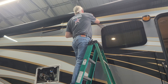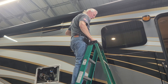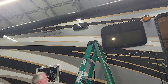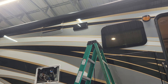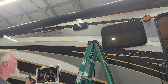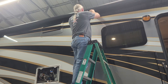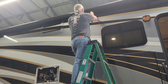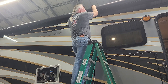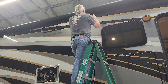I'll do a little mark here — black sharpie doesn't work too well on black paint, but you can see it. I'm hoping the stud I found down here actually goes all the way up to the top — we shall see. I'm going to place this up there and mark the center holes for where I need to drill. There's the center line. I had Angel test it while I was holding it. You're not supposed to push up on it — you're supposed to just give it a little bit of pressure. See how much it wiggles without pressure? If I just hold it there without pushing up, it doesn't wiggle. So this is where it goes.